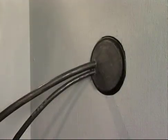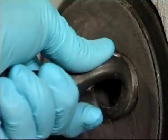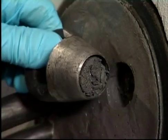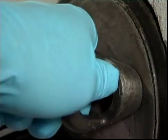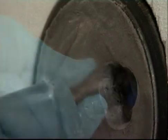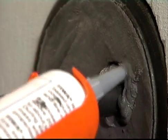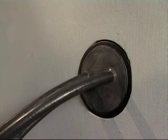Adding a cable is just as straightforward. A hollow punch is used to push into the 20mm sealant layer. The removed sealant remains inside the punch to create an opening for the new cable. Remove as much sealant as needed to allow the new cable or cables through the penetration. The new cable is pulled through an empty sleeve, and FIWA sealant is used to seal the free space around the cable and is then smoothed in the usual way. It's simple, quick and cost effective.